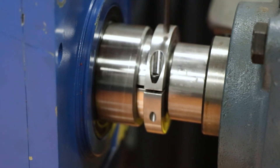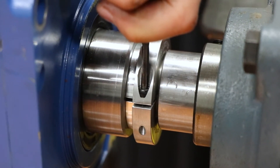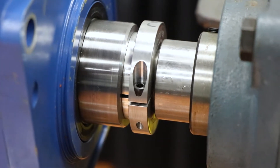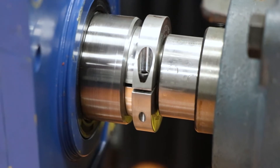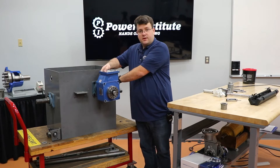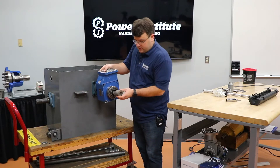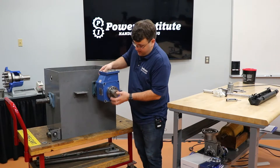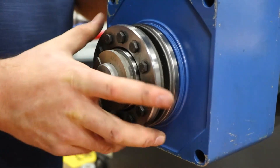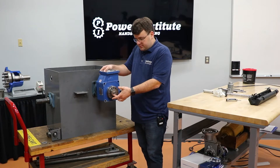Once it's slid onto the shaft, you want to tighten down this rear collar. Grab the right Allen wrench and tighten that down to the torque spec that's in the manual per the size. We'll get it hand tight for now, but make sure to come back and tighten that with the torque wrench. That's the rear collar. Now the unit is staying on the shaft, the rear is all the way up against the shoulder on the back side, and we go ahead and put our outer support bushing on. This might take a little doing — you may have to wiggle the unit a little bit, but you're going to mount it on the bore. Push it all the way in until it stops, up against the hollow bore of the reducer, and your bushings are all the way in there. From a positioning standpoint, the reducer is positioned.